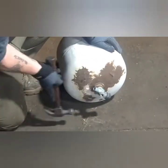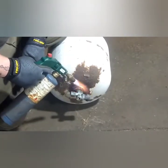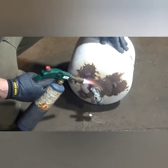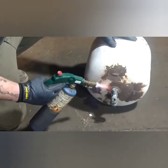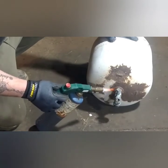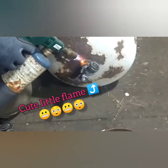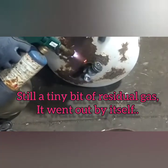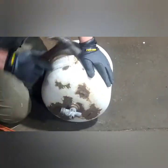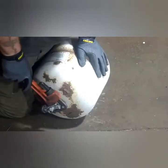This valve has been in here for a long time and it's going to be very corroded and locked up. So what I'm going to do is give it a little heat around that collar — things expand when you heat them. Don't heat the valve itself, just heat the steel around the valve. Then I'm going to give it some love taps with the hammer to knock it loose, and grab a big pipe wrench too if you've got one. It worked pretty well in my case.